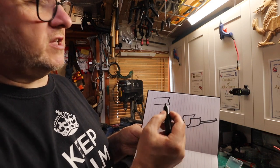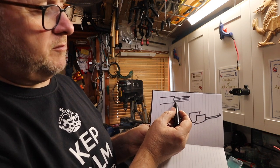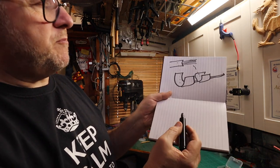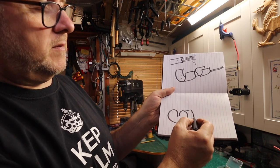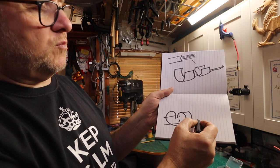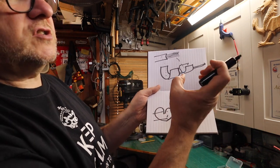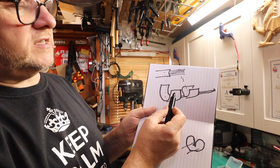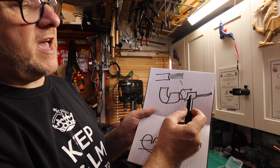So there's the PVC insulation of the cable, and there are the strands of copper you've exposed. So that PVC will go into this area, and these strands will go into that area. And when they crimp, they will actually crimp like that. So the cable will be trapped, and the same with the wire — they will crimp down onto the wire, and the crimps come down and form a circle coming in on itself. So the reason there are two: this holds the insulation, the PVC outer sheath, and that does the electrical connection.